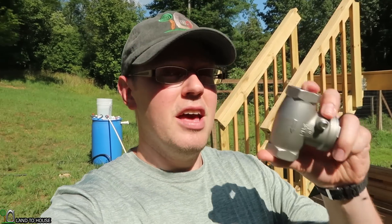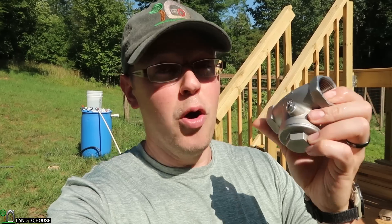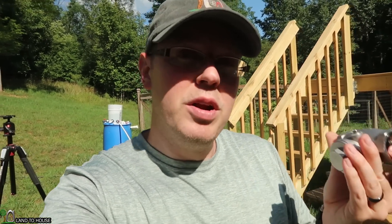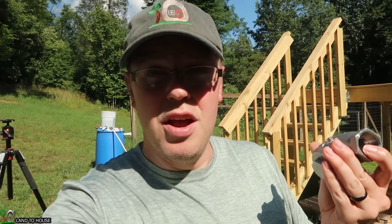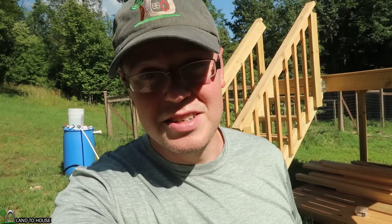So you do want to have a valve that is heavy enough, like the brass swing valve. But I want to increase the quality and lifespan of my Landahouse ram pumps, and that's why I am considering stainless steel valves. This right here is hopefully going to increase the life of the pump from one year to maybe two or even three years. It's also going to increase my cost by a good bit, but I think it's going to be worth it.